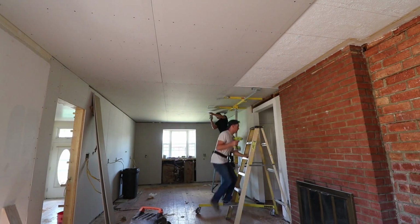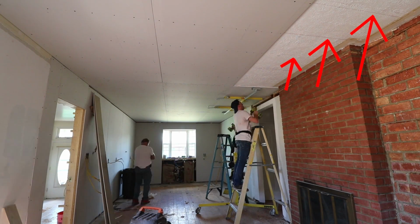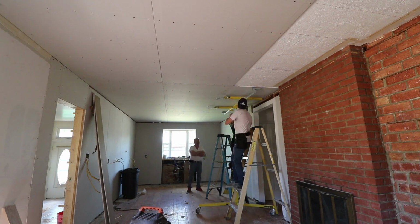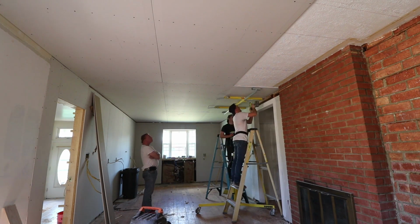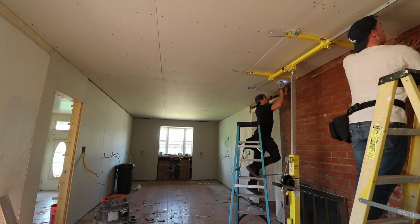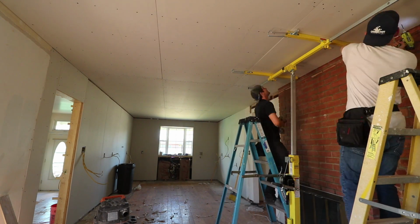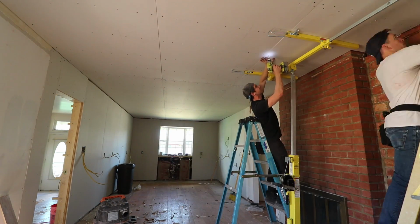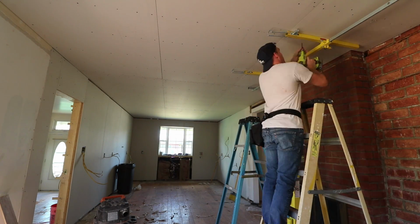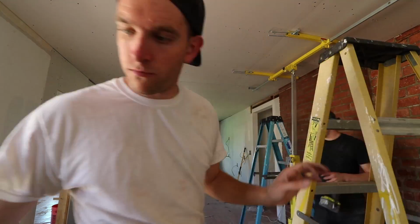Before hanging any drywall, we marked the full length of the joists with a heavy chalk line, and even marked the top of the walls at the end of each line. This would guide us when driving screws, so we would go directly into the wood joists and not just the old ceiling. When hanging the drywall, we loaded it with construction adhesive, raised it up, maneuvered it into place, and drove in just an obscene amount of screws.